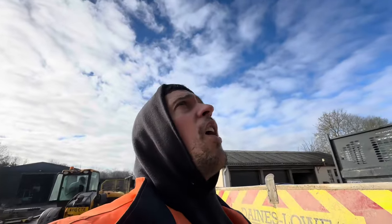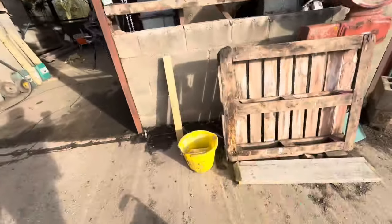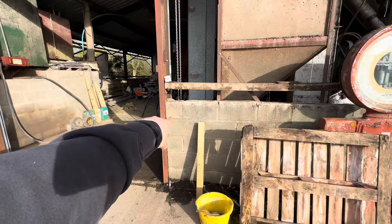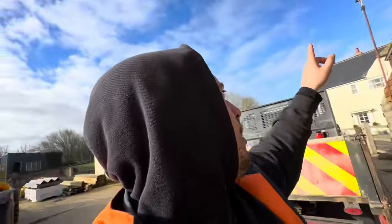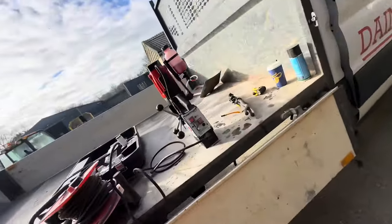Good morning. We are on site, final prep work for concrete boarding. So we've got to put some lovely brackets. The farmer has made us some lovely brackets over the weekend. Got to put those at 10 foot up from the bottom, from that mortar course, 10 foot up brackets, timbers, all the way on the front and back. We need to get timbers in the web, on the up and down, on the angle, same at the back. And obviously to drill the holes, we've brought our lovely mag drill.